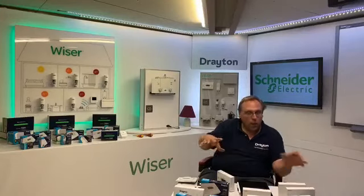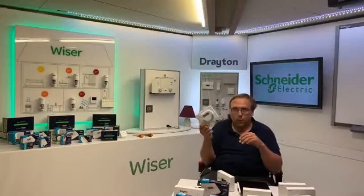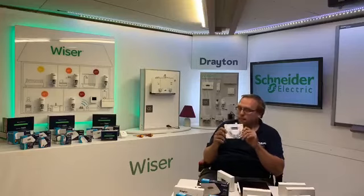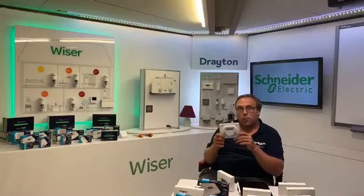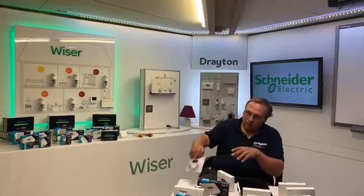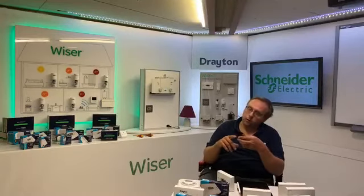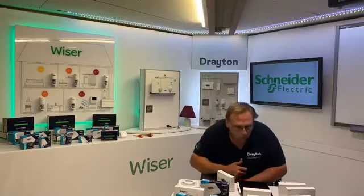The last thing I want to show you today is the clip-ins that go into the Greenstar boiler — I've got a mock-up of a Greenstar boiler behind me. Again single and two channel: the LP20 is the two channel, the LP10 is for a combi. These clip in and go into your Greenstar boilers — anything except the 25 and the 30, you can't use them on those, but any others in the Greenstar range you're absolutely fine.